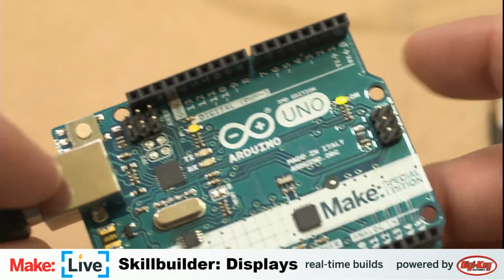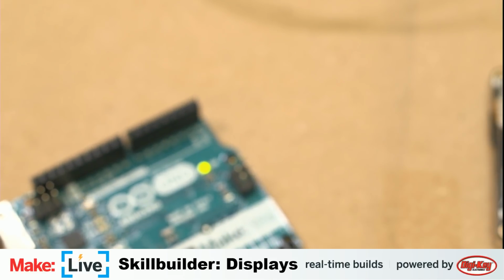In fact, you and I were just at a hardware meetup a few weeks ago. What was the gentleman's name that was speaking there? Joe Grand. His demonstration there was how you can use LEDs to get information out of hardware that maybe the designers didn't intend to. If it's something like a network router, they probably have that LED wired up so that it turns on when it's sending an on binary bit and turns off when it's an off binary bit. And that's data.